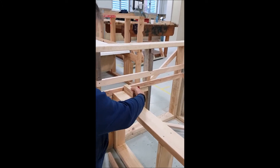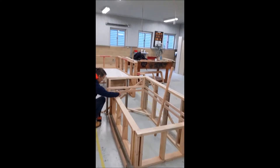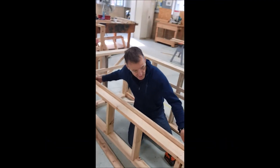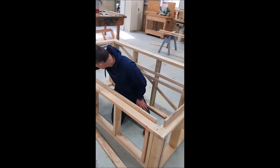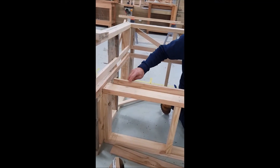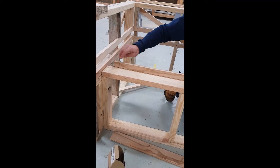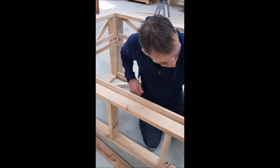Each of the baths could be slightly different. So when we come back, we'll have this secured off and we'll be ready to install this bath. I'm just installing this supporting piece on the outside wall here. I've just cut that short either end, just to make sure that they don't foul up on the curved area on the bath. As you can see, I've got that up a distance — the distance ends up being 37mm for this particular bath. It was 21mm short to allow for the tile, villa board and a little bit of a gap underneath the edge of the bath. I just put a marking gauge along, ran the pencil along so I could see it, and I'll screw that on.